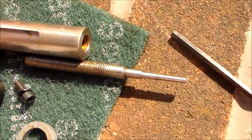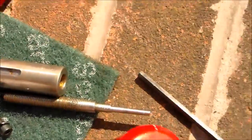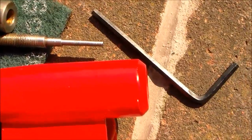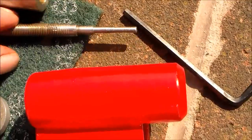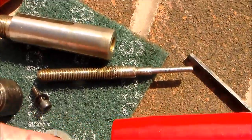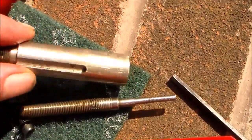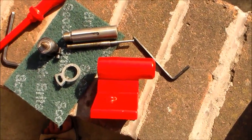Then as you push it along, this bit on the front will stop it going too far out the other way. What we need is to check that it's hard up against the end of this so that it pushes against the back as it's screwed out, and as it's screwed in, whatever's clamped on the end will pull it back to move it backwards and forwards inside that bore. I'm told that's just a parallel bore down there — we can check that a little bit later. So that's the tailstock disassembled.